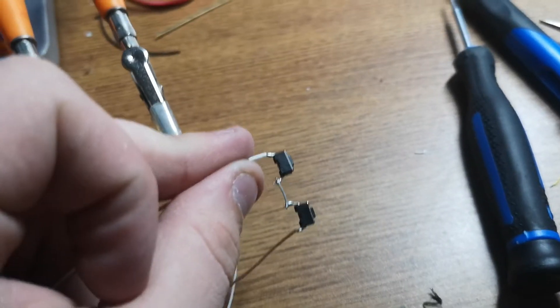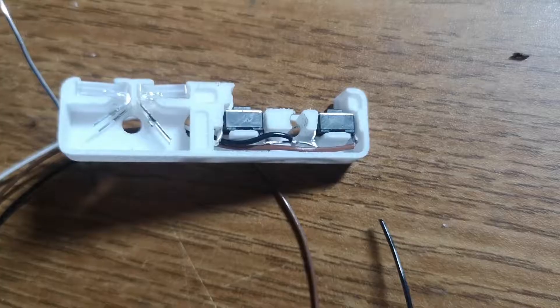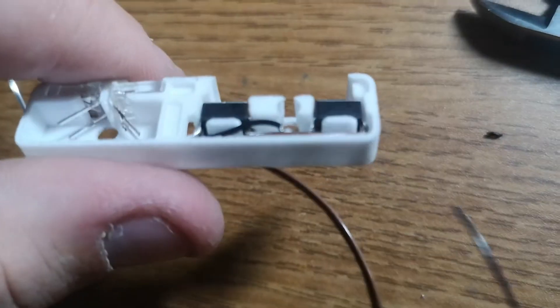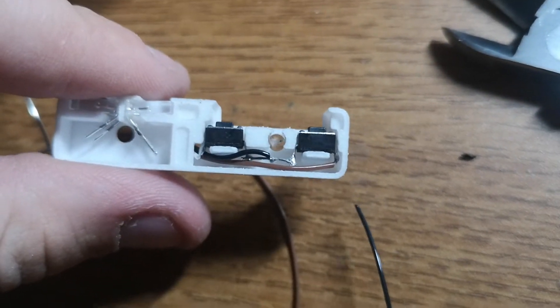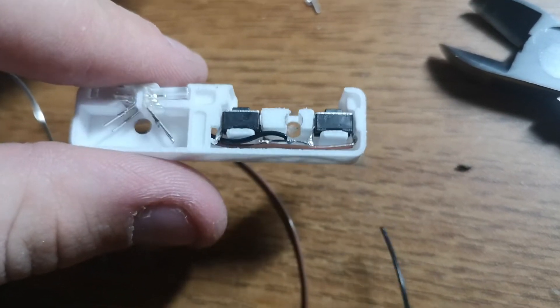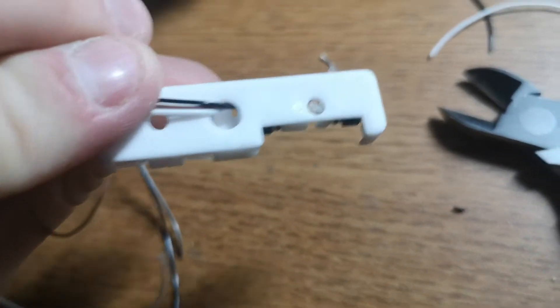We have our switches all wired up. You just want to check that your leads are strong and then insert them into the box and route the wires through the middle. If you've chosen to use a resistor leg to bridge your grounds, you can solder the wire anywhere onto that leg. If you're wiring them with a wire, solder a second wire onto one of the legs and connect them that way. Remember, the wires go through the middle, not either side.